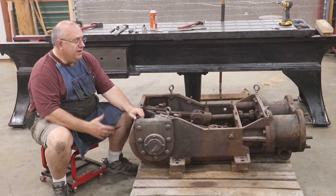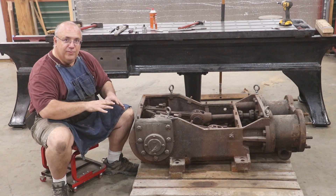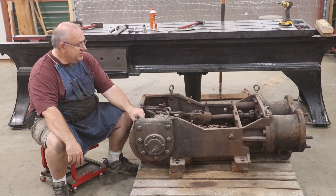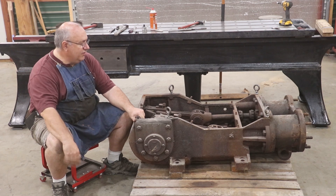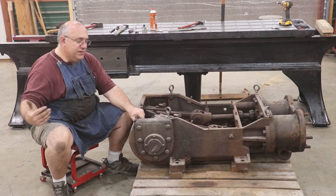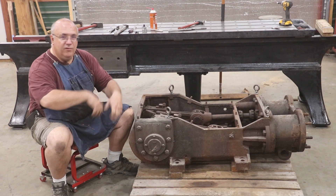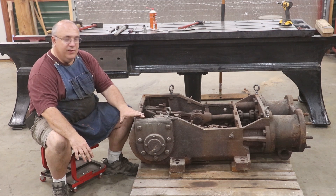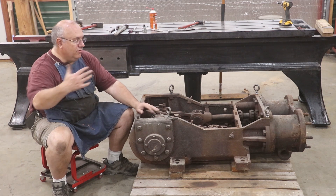This right here is actually part of that steam locomotive — what you'd call an appliance. It had nothing to do with the actual running of the locomotive directly, but it helped the locomotive run. This is a stoker engine. It's actually a steam engine. It doesn't power the train, but it powers an auger up in the tender of the locomotive — that's where they carry the water and the coal. That auger feeds coal from the tender up into the firebox, basically replacing the old days when the firemen had to shovel coal by hand. They could just turn some valves on, it would turn the steam engine on and start augering coal up into the firebox.